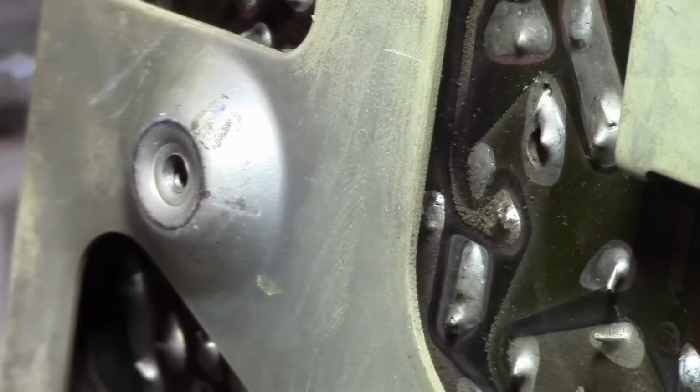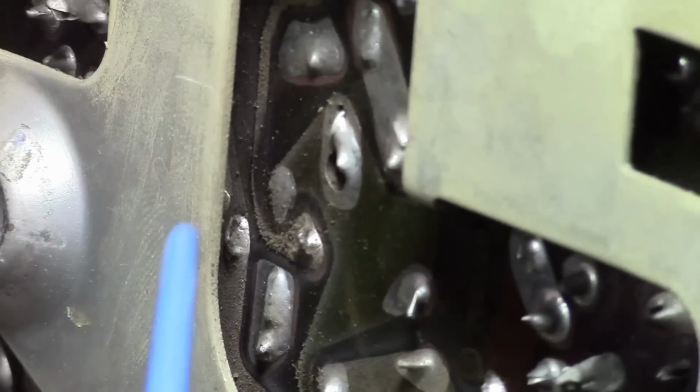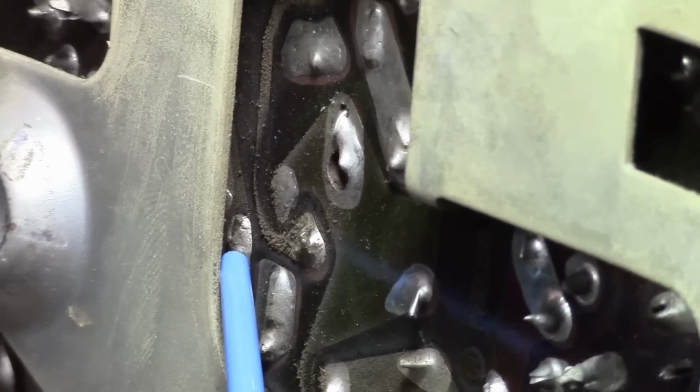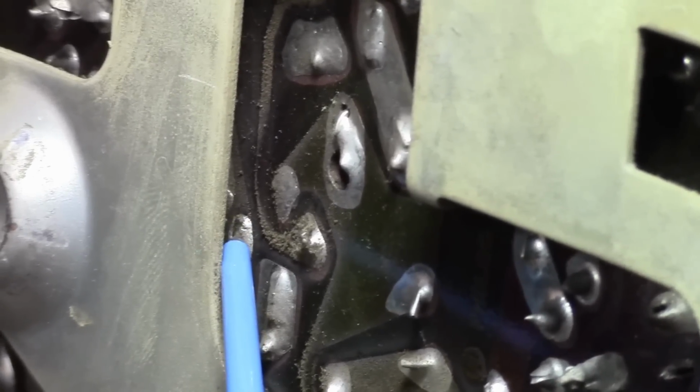Come on, folks, there we go. The trace is intact. The little lead coming through is actually, it's like a cold solder joint. Now what about the other end of it? Ooh, that's tough to see. Pardon my head. Same issue. See if I can capture that.